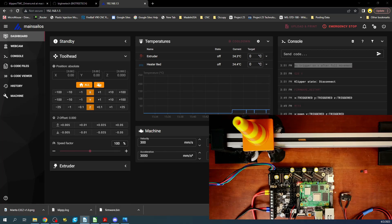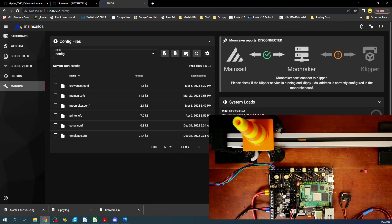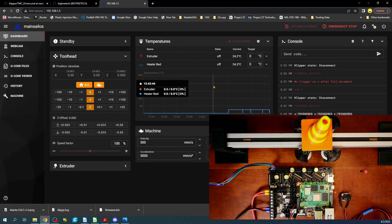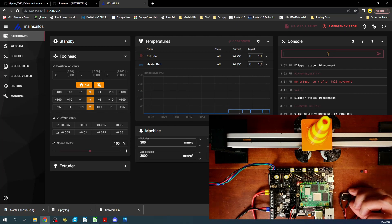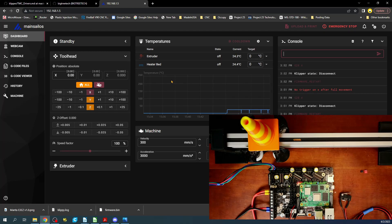To fix that, I'm going to put in a command for homing retract distance and make it zero. Going to machine printer config, down in the regular config portion, I paste the command 'homing_retract_dist: 0' — this should take care of that issue. I'll save and restart, go back to the dashboard, and run G28 X again with my finger in place. This time we don't see the error — so we've solved that.